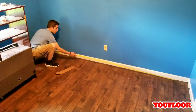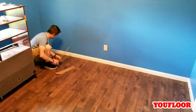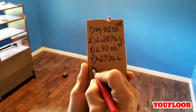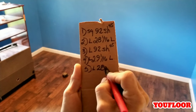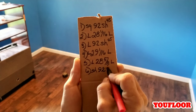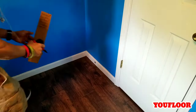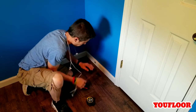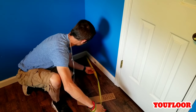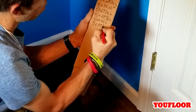You'll notice that I'm skipping the small piece temporarily and making a mark from the right wall to the left at 92 inches, then I can measure the next one in line, which is the small piece. I do this because I always want the bevel on my splices to face away from the eye view — that way it's almost flawless when viewing it from the main area of the room. This next piece will be from long to return. The door trim sticks out past the baseboard in most cases, so the piece at the end — what I would call the return — has to have a finished look. We usually just cut it square and then turn it on a 45 and cut it about an eighth of an inch down.